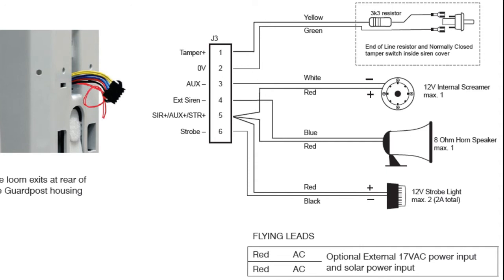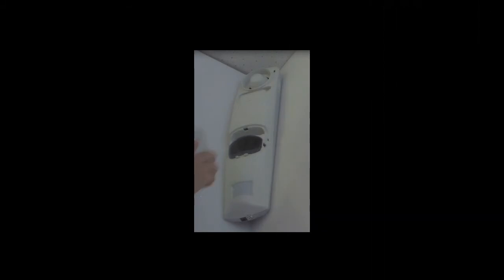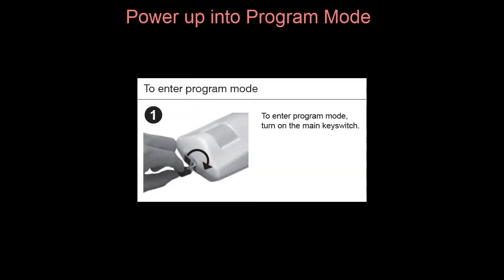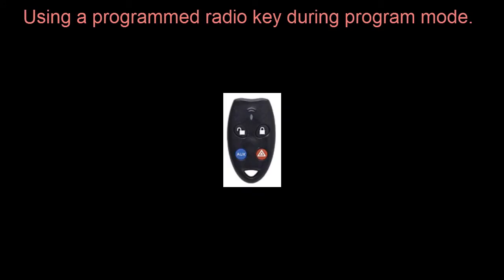Once you've fully secured the security guard onto the wall, fitted the cover grill and the display cover, we're now ready to power the unit up and start to program it. To enter program mode, you have to have the system fully powered down — that's done by the key override at the bottom of the unit. You then turn the system to the on position, and that will display on the LED display the version number of the system. The security guard's radio key, or remote control, has two functions. When in programming mode, we use the buttons to cycle through the programming options, select them, and save them.